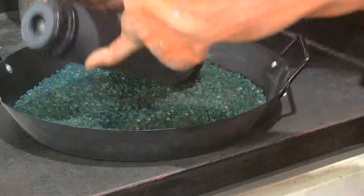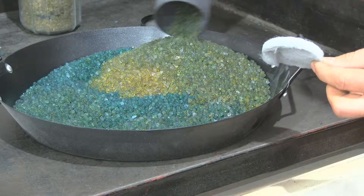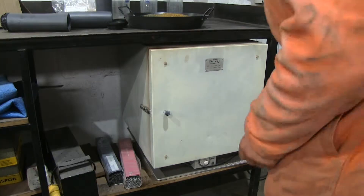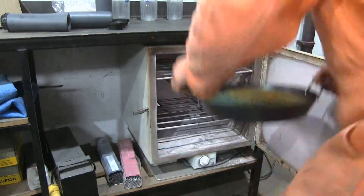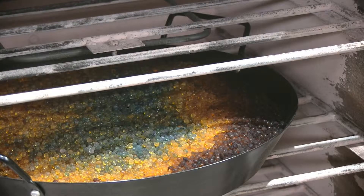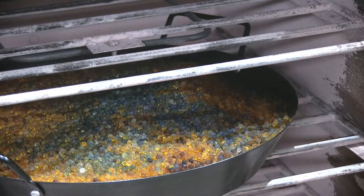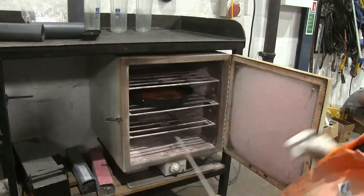I mainly do welding work and I have a welding oven which I was considering using to regenerate these silica gels by cooking the moisture out of them. The manual says I should keep the oven at about 180 degrees. Unfortunately my oven didn't go that low in temperature, and without me realizing it I actually destroyed the silica gels. The darker ones look like they just changed color but they are going to turn into a golden brownish color.